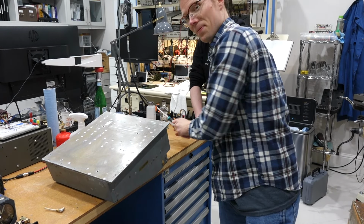The fuel cells were quite powerful at a max rating of 1.42 kilowatts each. They produced the power for the whole spacecraft in the form of DC voltage, varying from 27 volts to 31 volts, depending on how hard you ran them. They had 3 fuel cells, but the whole mission could run on only 2, and as NASA diminutively puts it in their operations handbook, you could successfully terminate a mission on just 1. Of course, on Apollo 13 they lost all 3, and they were lucky to have the LEM attached, or the situation would not have been recoverable.